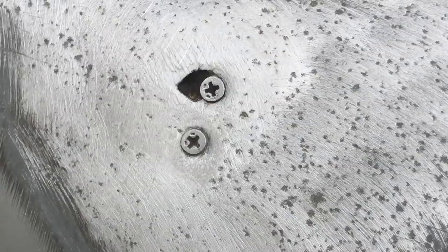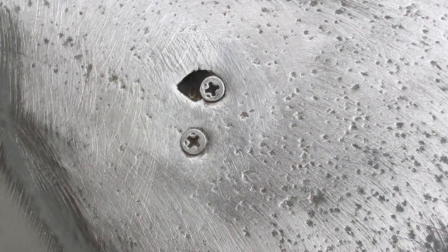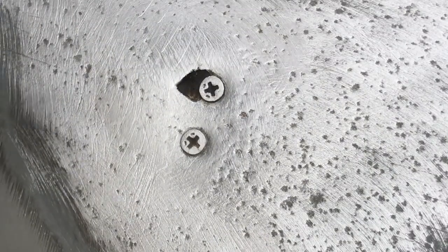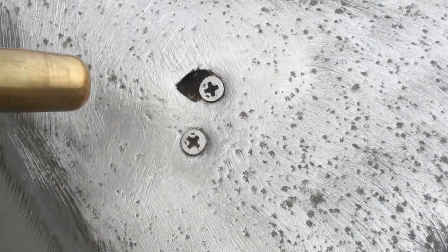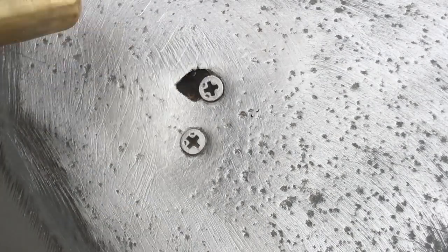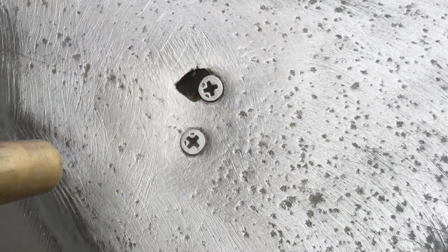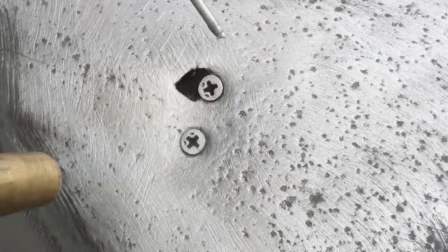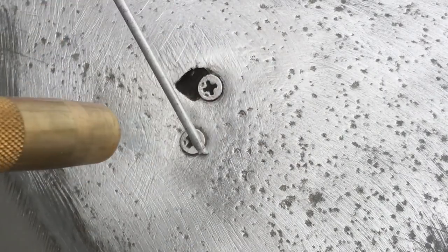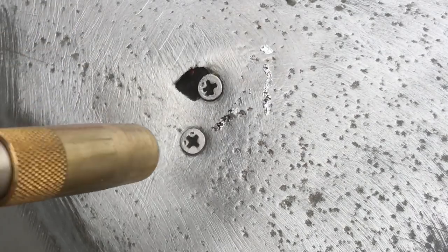And that's another one. This time I got a hole. It's a pretty substantial hole. But the process is the same. You're gonna notice that there's some warping of the aluminum from heating it up. So you go kind of big instead of just focusing on one little pinpoint. It spreads that distortion out a little bit.